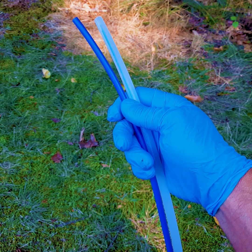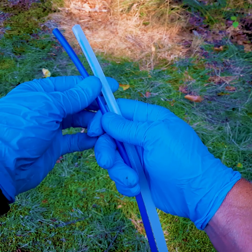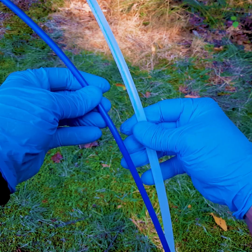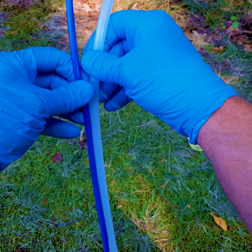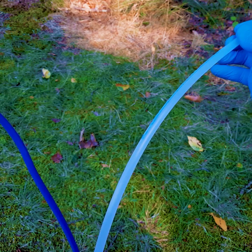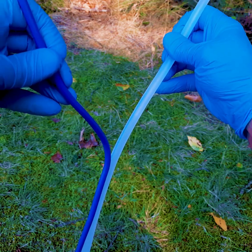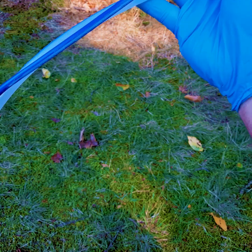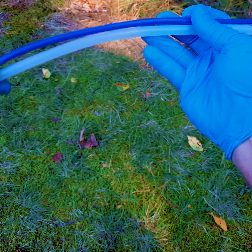The tubing I'm using today is also manufactured by Geotech Environmental Equipment and in my opinion is the best tubing out there. It's considered bonded tubing where the air line and the water line are bonded intermittently. The beauty of this tubing is that it's strippable — you can see how easily it strips apart, and again it's intermittent. I know a lot of you in the field have struggled with separating these two tubes by cutting with a blade and ending up cutting into either the water line or the air line. So this is a great feature of Geotech's tubing.